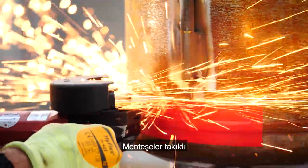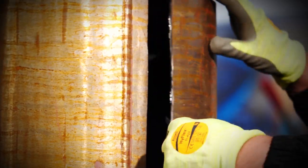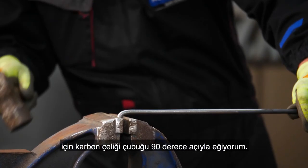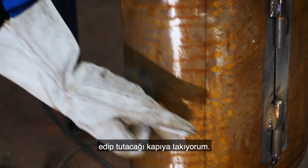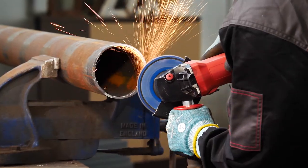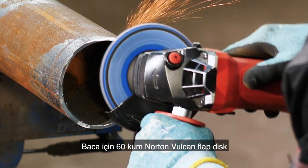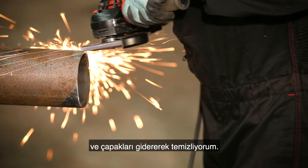The hinges are in place so I'm going to cut the rest of the door. To complete the door I'm bending the carbon steel dowel to a 90 degree angle. After cutting, I weld the dowel onto the latch plate and then directly onto the door to create the handle. For the chimney I'm using the Norton Vulcan flat disc again in grit 60 to tidy the pipe and remove excess stock and burrs.